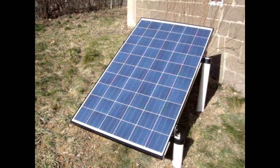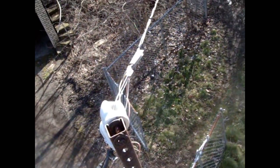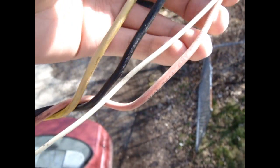I'm going to be tying this panel into my garage electric, but these lines need to be upgraded. This is the line that will need to be replaced to the garage, and here's the solar panel. On my next video I'll be wiring that panel up. If you're doing an outdoor installation you're going to want to use a USE-2 wire. They just have THWN or THW wire — it's good for submersible pumps, but this wire doesn't hold up to intense sunlight and weather very well. So you want to get a USE-2 cable for outdoor solar installation. I'll try to replace all this and run a new line so we can get the panel hooked up.